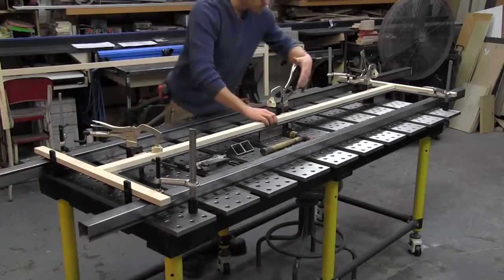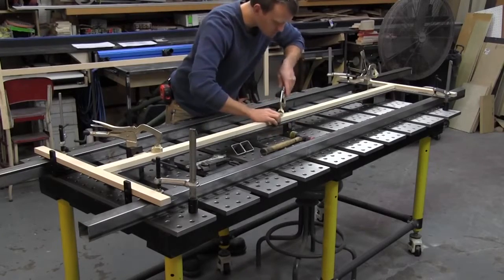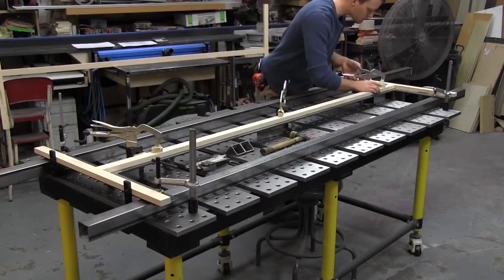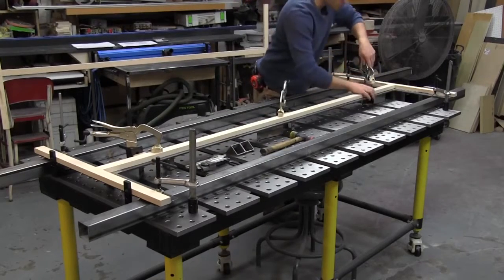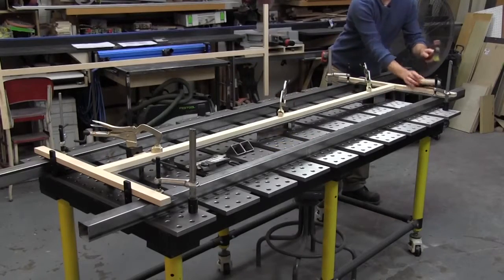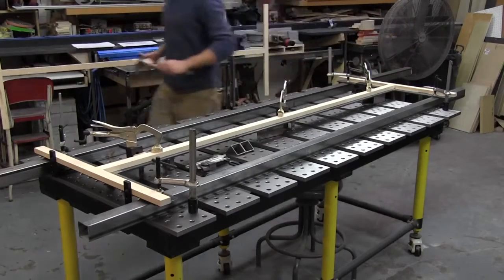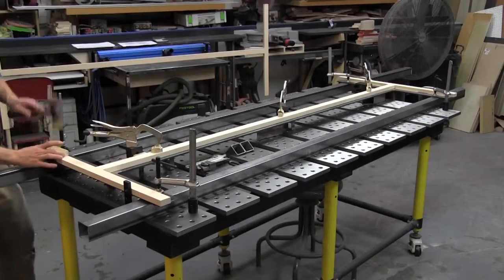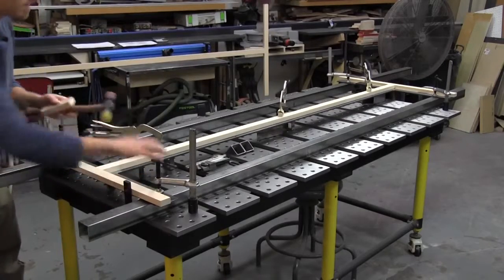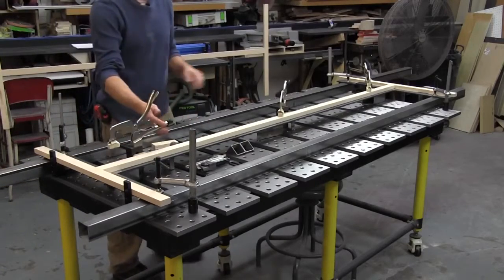I'd put the wood member in the fixture and clamp down, which would press an indent from the transfer center into the wood component. And then I'd tap the ends of the T-shaped pieces to mark those hole centers. This way, even if the wood components were a little bit bowed, they were held straight in the fixture, and I had a mark to index my drill bit. All the surfaces were in plane and aligned with each other.